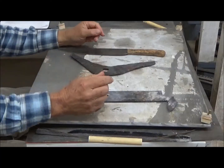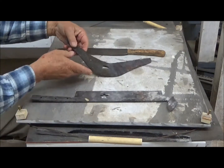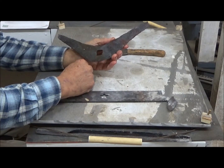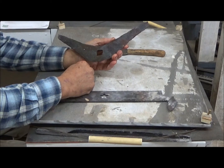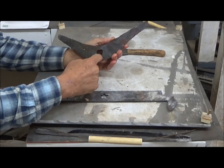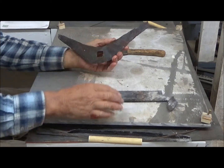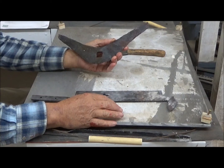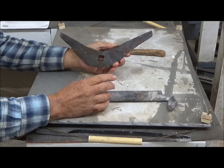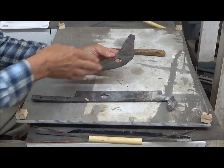You can see the amount of rust on that steel and the bends that I pounded out of it. After our initial try at the forge the other night, we have decided what we're going to do with shaping these knives. With this one, we're actually going to, of course, make two blades as we always thought we would. And I'm going to put this back on the forge and take the cold chisel and cut this steel into two pieces here. And then we'll be able to work these separate shapes into quite different shaped knives. Now, this is already tapered down somewhat here, although it's so rusted it's hard to say. But this is going to be the back of the knives here, and these are going to be the edges, ultimately.